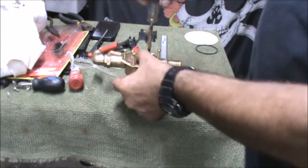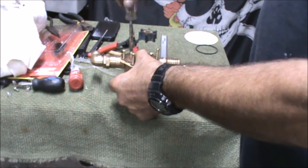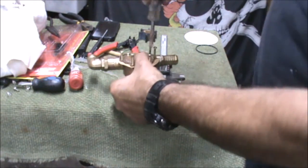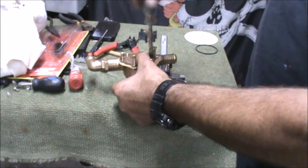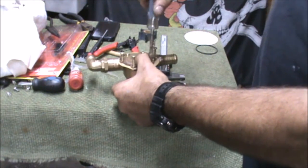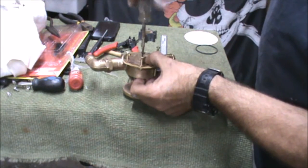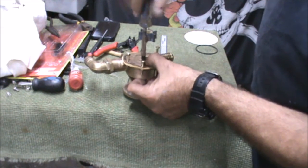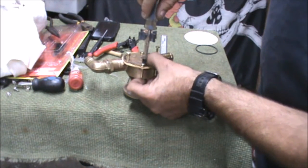I'll just lightly hold it there, basically because the impeller can be pushing the plate out a little. So we'll just work our way around, do those two little ones and then get these. These are pretty long but that's alright. What I'll probably do is just put a dollop of Loctite on the back side of them so that they can't pull through or undo by mistake, there'll be a blob of Loctite on the other side. They're long screws, longer than required, but they were just the right size and I got them for $2.50. I couldn't be bothered trimming them down, they don't need it. Worst case I could whack a nut on the other side but they don't need that either.